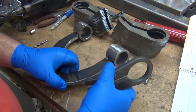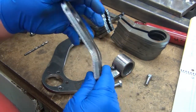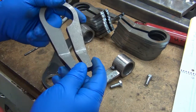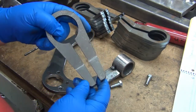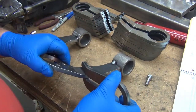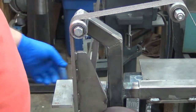In order to put these on here, when the metal gets bent you can see the middle is pinched together a little more - that's partly from the die pushing in and partly from the metal stretching. It's got to go somewhere and it's being compressed on this side. So I'm going to grind that with the belt grinder because it'll normally slip over easily but then when it gets to that bend part I don't want it to bind.